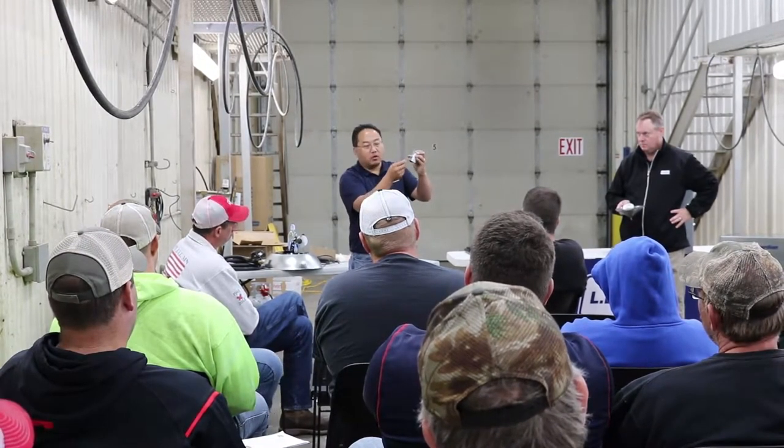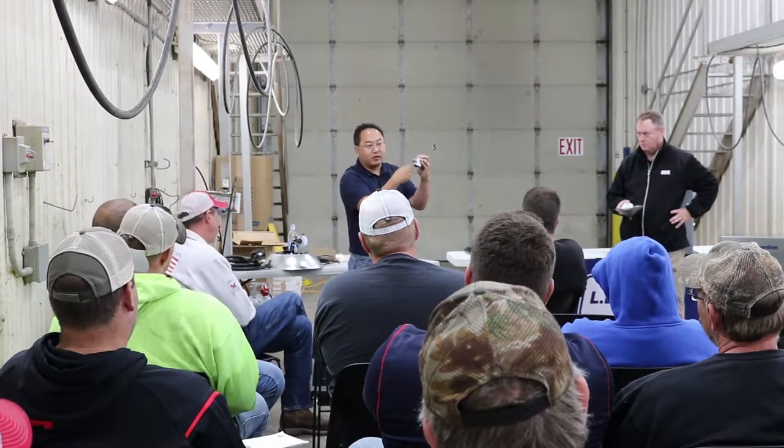So what you want to do when you replace the valve — you have to replace the whole valve. Make sure you soften it up with a lighter first, soften up the metal, soften up the liquid lock-tight. Once you soften it off, you just pull it off. You'll need to lock it back — the valve will come with a little pack of lock-tight. Those green lock-tight packets — remember, that's a green liquid lock-tight.